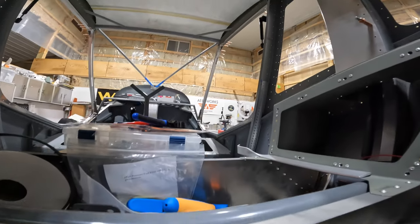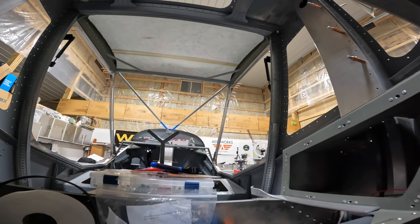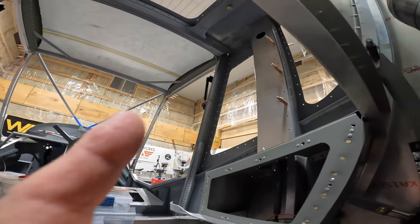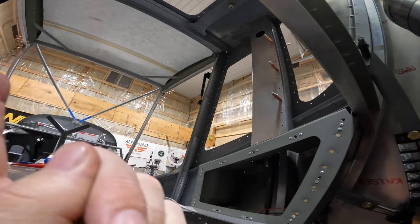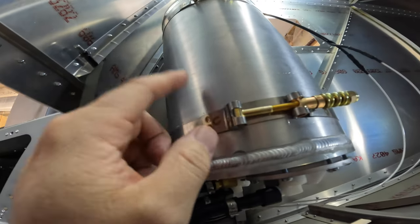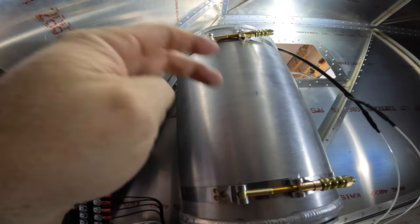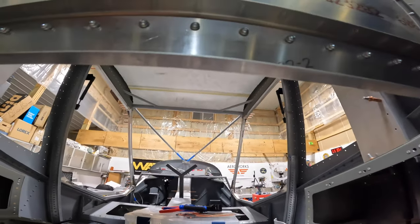And then we're going to jump back up to, once we get this new valve in, putting in the valve on the archway there. And then we're probably going to have to change a couple lines to a little bit shorter. But what we'll have is basically from the bulkhead fitting up there, a straight through right directly to the valve on each side, left and right. And then we'll have a third line feeding back into the header tank. So now only one line coming into here. I'm going to talk to Jan about that tomorrow. We'll still have the two vent lines coming in, but we'll have one feed line, one fuel filter coming in, pre-filter, and then we'll have the ability to switch left or right up on the archway there.